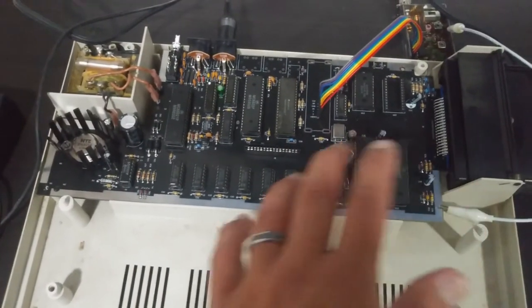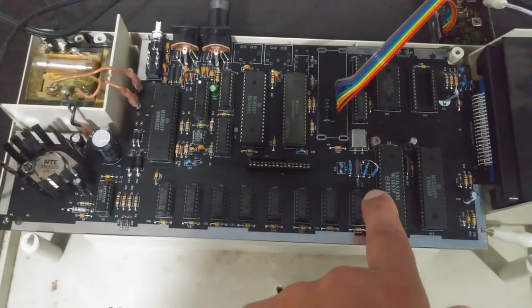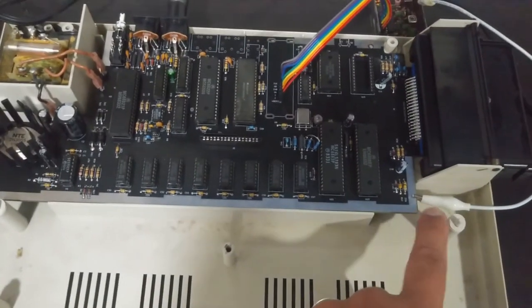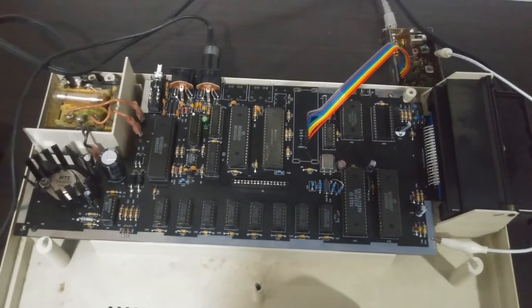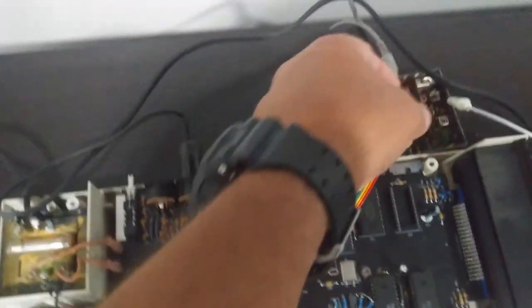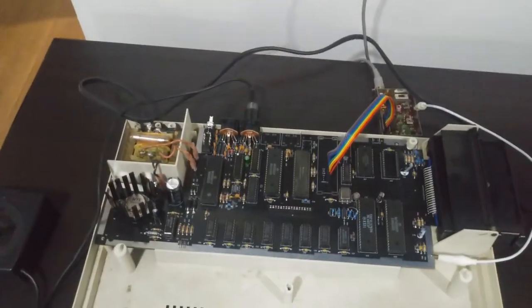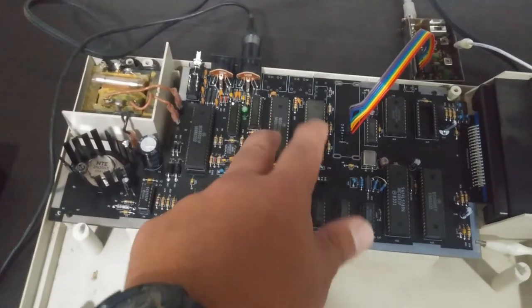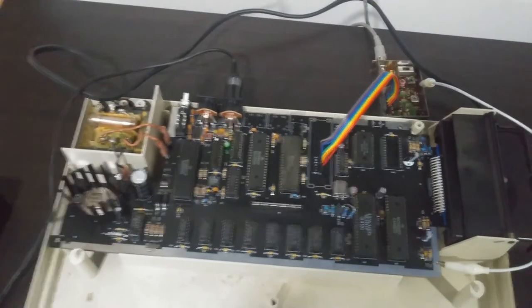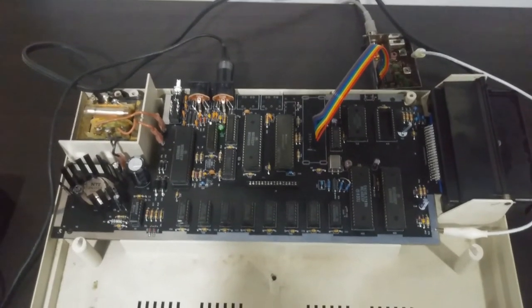The board — the idea is to have a direct replacement of this version of the Coco 2, and I'd like to keep it as original as possible. The board, other than two or three things I found with it, mostly worked. I did find that the model I used for the SAM chip had the E and Q lines crossed, so I had to make a little fix there. The board was also a little bit longer than it should be — I fixed that already. I'm going to have to reorder some boards. This is built using brand new components, except of course for the ones you can't get anymore like the processor, the SAM chip, the VDG, the 6822, the 6821, and the RAM. But I can use this as a base later on to start replacing hard-to-get components with newer ones.